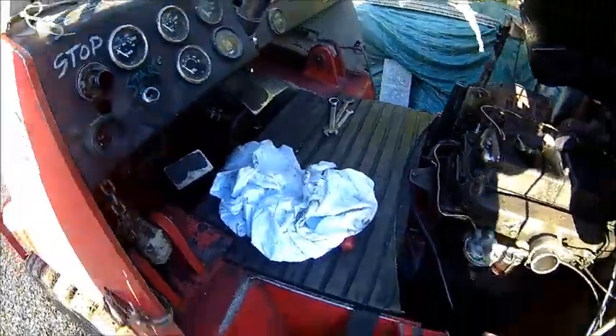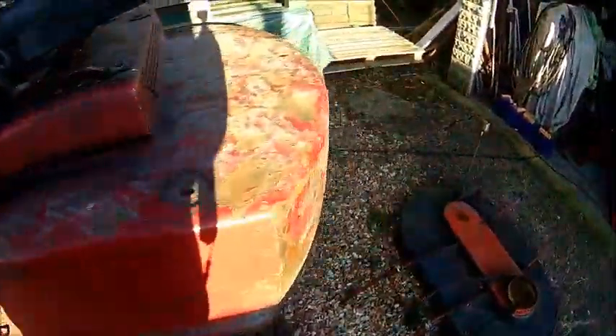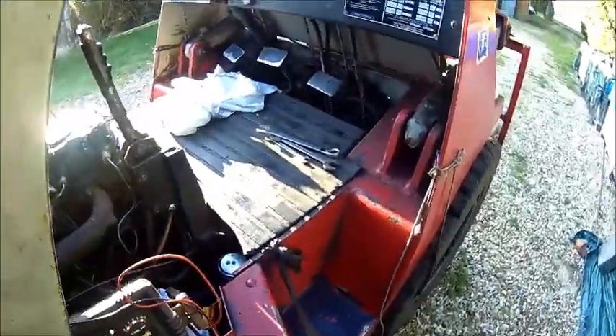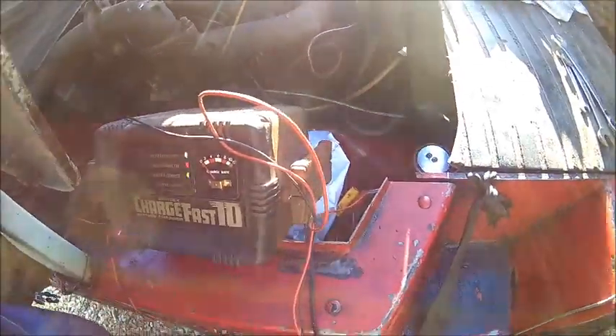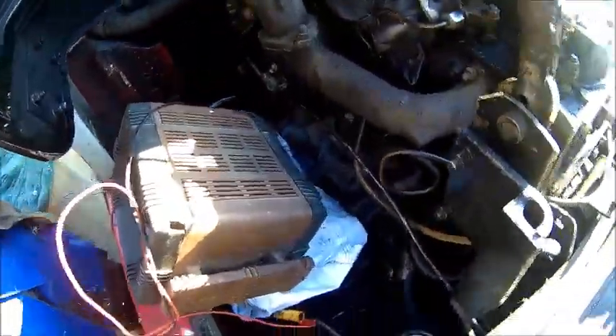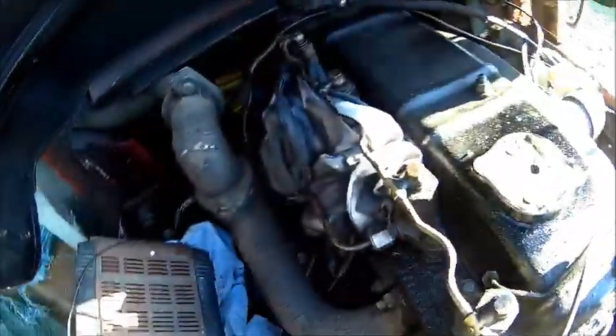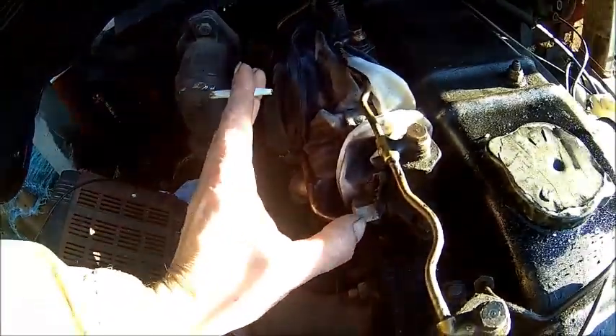The brakes are bad — I almost hit the workshop. The handbrake works, but the battery was dead. The main issue we have is... it runs and drives, it's just been neglected a little bit. The tilt cylinder is leaking. If one of these nuts is split, so it's pouring out fuel.